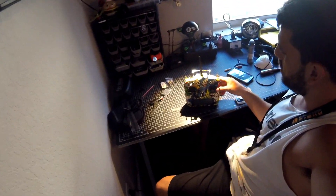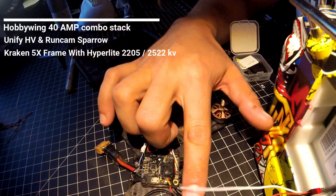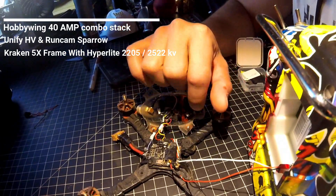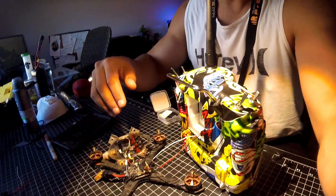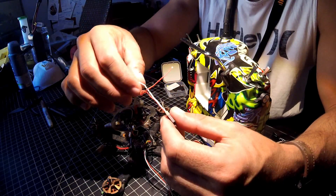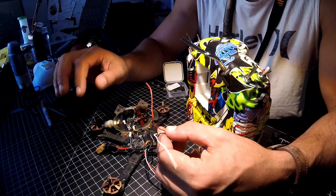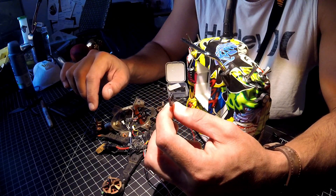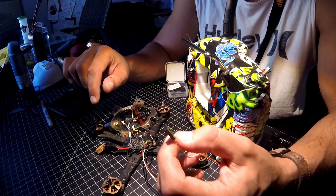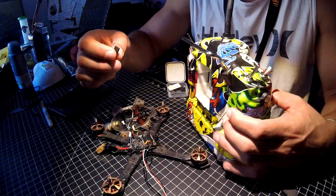So this is my little workstation right here. As you can see, I've got my receiver and my XM Plus resting right there on top of my flight controller. You might be wondering what's going on - I took the 5-volt, ground, and data cable and hooked it up to my remote. Basically, what you need to do is find one of these three-wire connector harnesses. You probably get it with flight controllers or power distribution boards. It's basically a little three-wire connector harness that looks really old school - you'd probably throw them all out. Hopefully you didn't, because you need them to plug into the back of your remote.